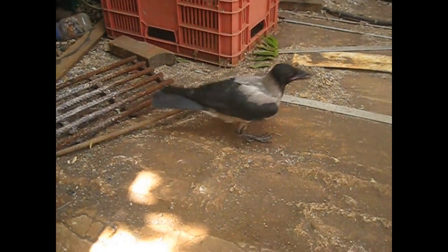The width is the same, 25 millimeters, but it is not perfectly square. In this direction it is 32 millimeters long, and in this direction it is 34 millimeters long. So it is compressed this way.